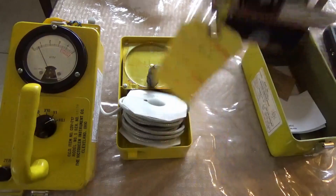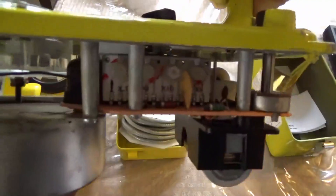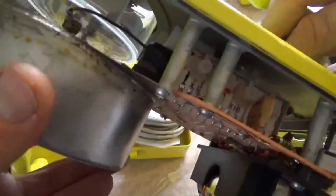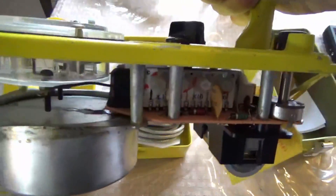On the side of the meters you'll see they have a calibration adjustment for each of the bands. Most likely your meter will have a mark where the original calibration was set, and your current calibration may be close to that or it may be off. It depends, because this is an ion chamber, and the ion chamber obviously is going to change with age. So that's what the guts of a CDV meter looks like.